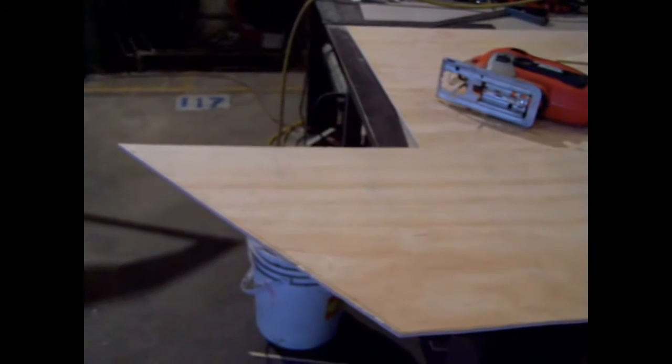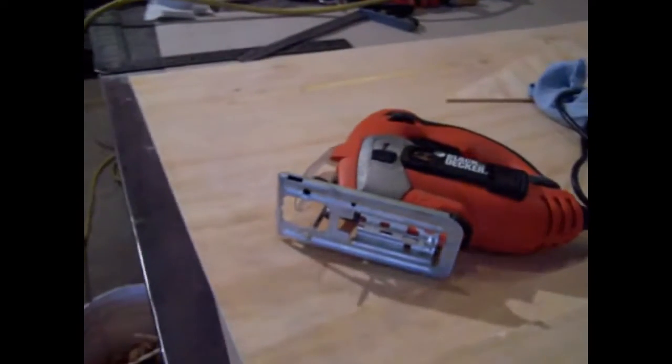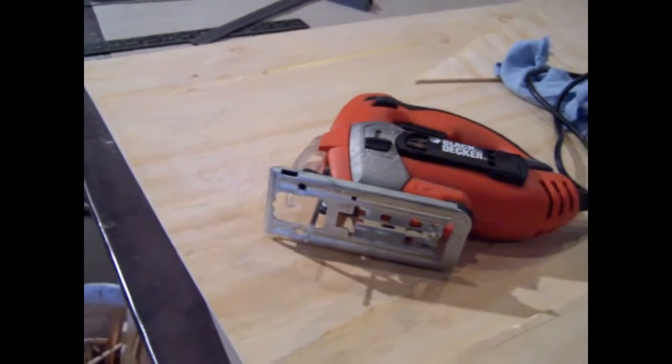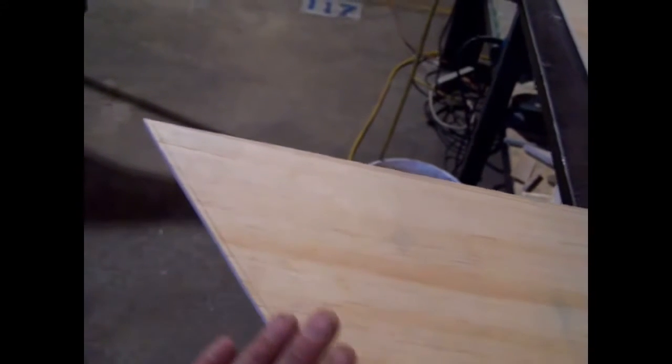I changed my mind. After I cut the piece 15 inches I put it up there, remarked it, and cut it to within a sixteenth. But I had to switch my jigsaw blade — I had a 10 or 12 tooth per inch on there and I had to switch to a 20 because this Luan really splintered up, but the 20 is beautiful. I also left three-sixteenths of an inch on the front where it's meeting the stem. I'm going to take my plane and put a bevel on there so when the two pieces come together they'll bevel into a nice tight point.